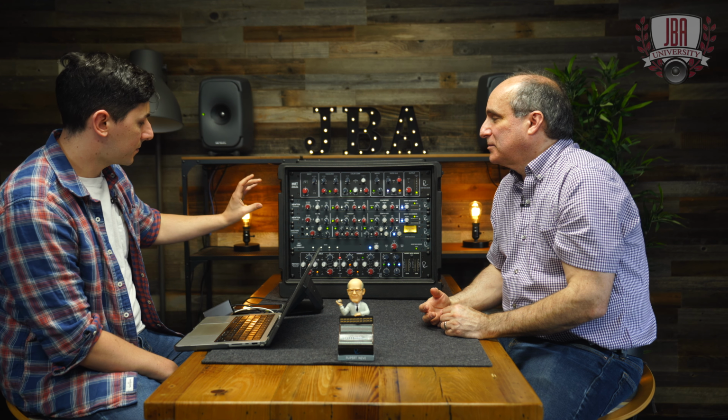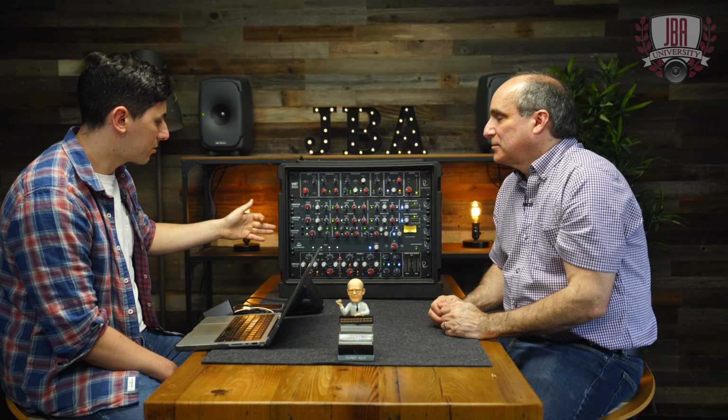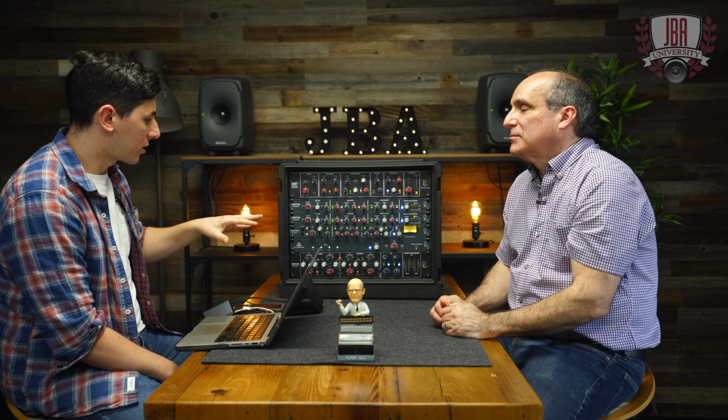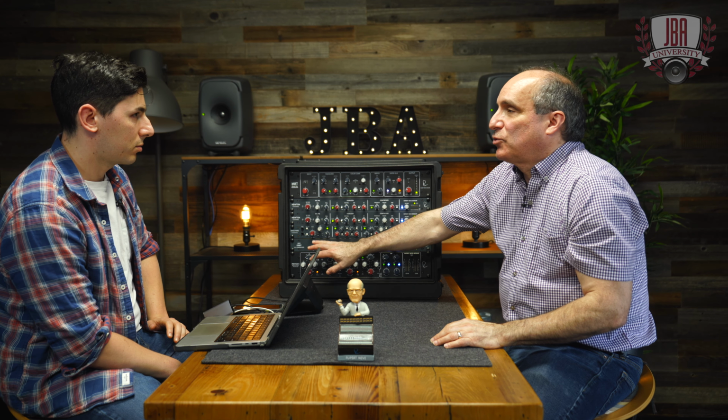As far as looking at a Newton versus a Shelford, I know we touched on that a little bit. Let me go very quickly over the main differences. So the Shelford has what's called a transformer gain preamp. The first 15 dB of gain come from the step up of the mic transformer. So in other words, it's using its ratio, or the step up, to push the transformer itself.